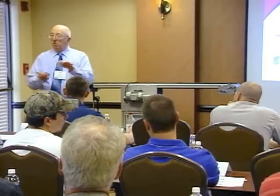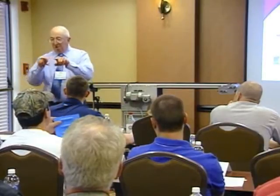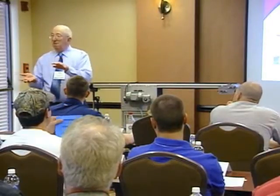These were made to compete with modular plastic, pure and simple. Okay? So modular plastic runs loose. It has catenary sag. The big problem with these, if you tension them up too much and they start to stretch, they get out of pitch and they will jump the teeth of the sprocket. So all we're trying to do is keep everything in pitch as it runs around those sprockets. Otherwise, what will happen is it'll engage with a couple of teeth and then it's going to hop out.